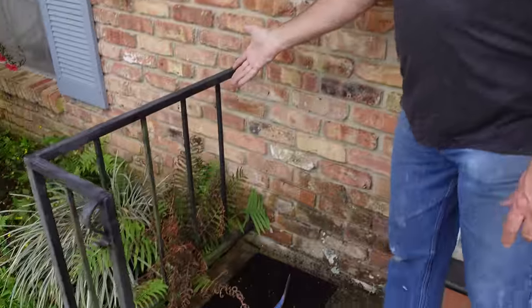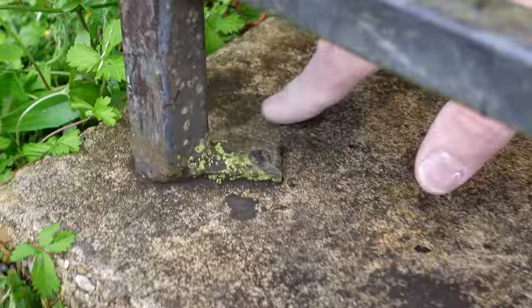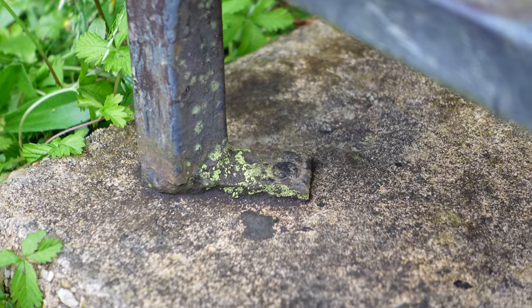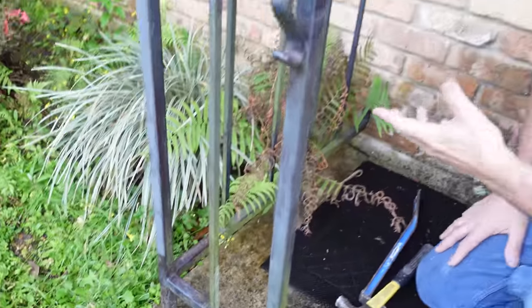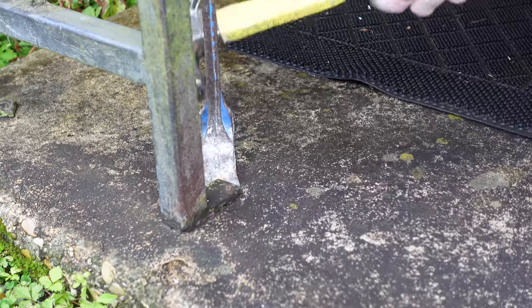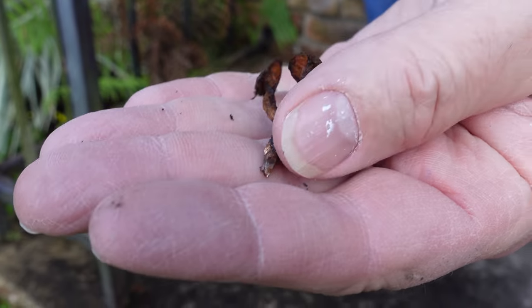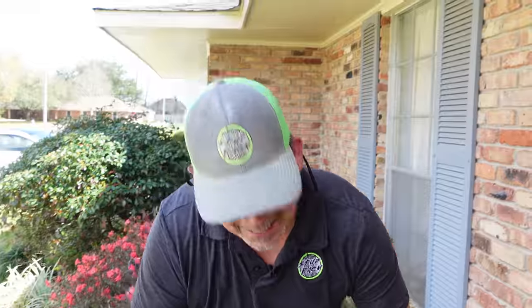The owner has this iron railing outside — we call it iron but it's really steel — and she wants it removed. Checking out the anchors, it looks like two nail heads. I've actually seen that done before: drill a quarter-inch hole in the concrete, drive one nail, another beside it, and it holds. This thing is pretty strong — obviously we wouldn't do that today — but I bet it comes up pretty easy. Look at that — there's your two nails. Who would have thought that would have lasted? I'd say that's 40 years original. That took 30 seconds — scratch it off the list. 'I thought you said demo was done.' I know.